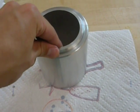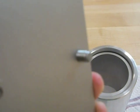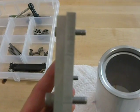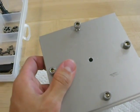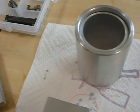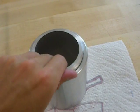This will be up a bit to about here. This serves as the top, which I just recently threaded with a one-quarter by twenty national coarse thread. It's simply quarter-inch 6061 aluminum stock, which will be welded onto the top of the inner cylinder, allowing for it to be removed very easily — a sort of hot-swappable design, similar to hard drives being pulled out of a server.